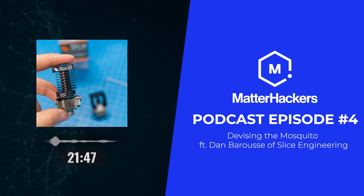Beyond the bimetallic design is the actual structure of the roll cage — with some off-the-shelf components cleverly put into the system. We basically took hypodermic needle tubing. The medical industry has been making hypodermic needles for a very long time and they're really good at it — they can make an extremely smooth bore on the internal diameter, which is great for filament passing through. The smoother that surface, the less likely the melting plastic is to get hung up inside and cause a clog. We took that idea and poured it into the hot end structure.